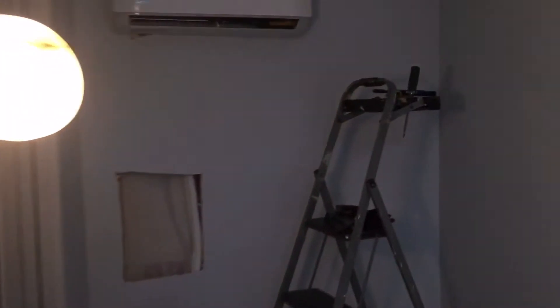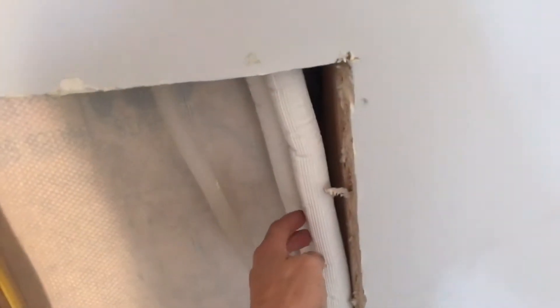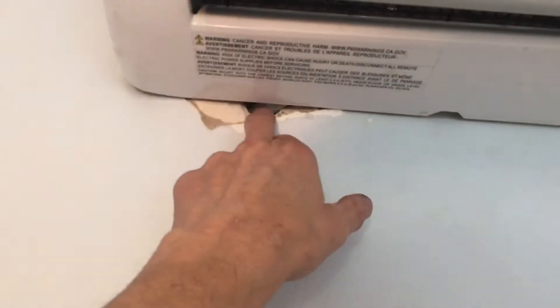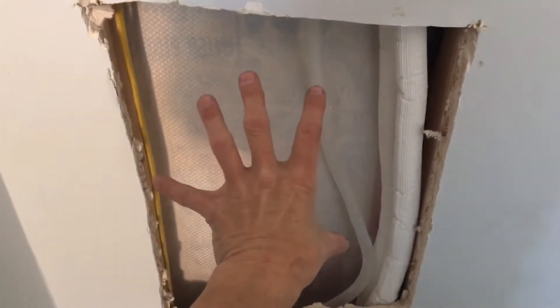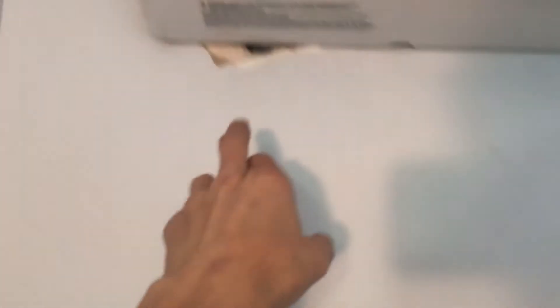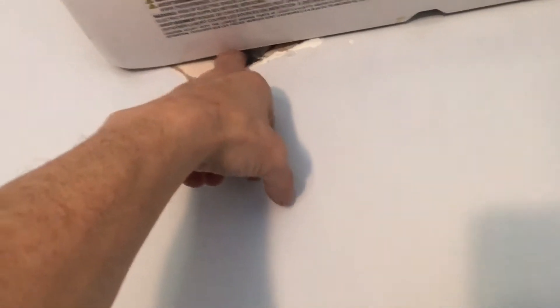As you can see, we have the high ceilings in here. If you looked at the previous videos, you've seen where the old insulation was ripped down and the copper was exposed to the air, which would cause water leaks, mold problems, and rotting. That was from their prior installation. The guy who's responsible for that big screw-up on this installation is the one who's going to come back and repair all of this. I'll put some fire foam back inside there.